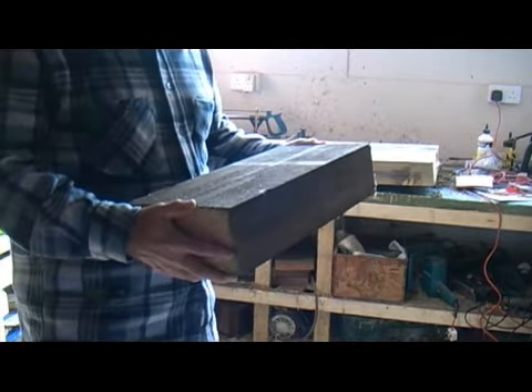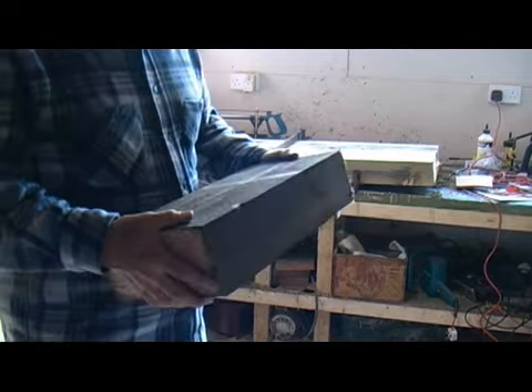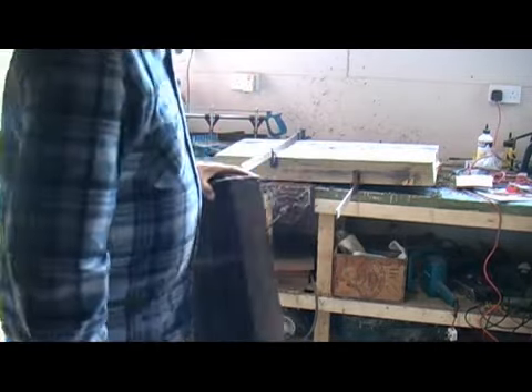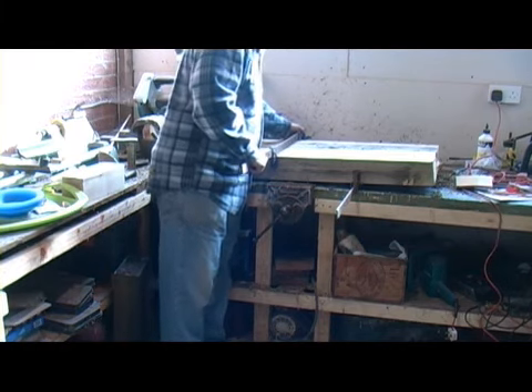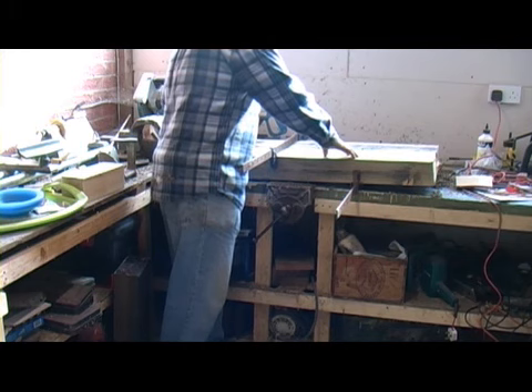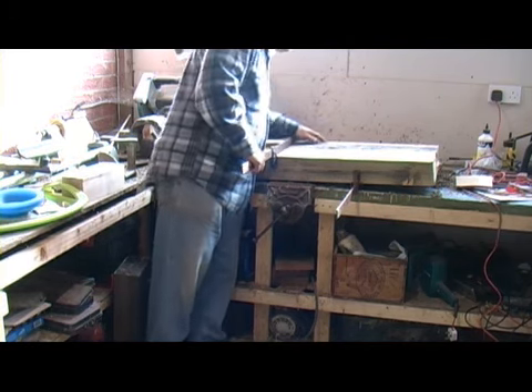I've cut my lengths to two 1-metre lengths, then used my electric planer to plane off the surfaces. We've then glued the two edges together, and that is now in the sash clamps with the glue gluing up overnight. One clamp each side to keep it level and glue it nice and tight. That'll need to glue right until tomorrow to make sure it's really strong.